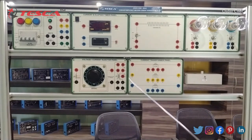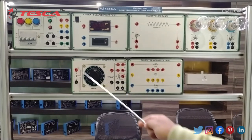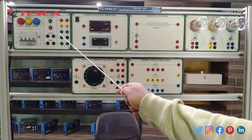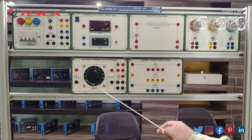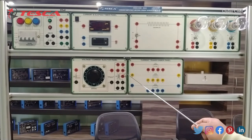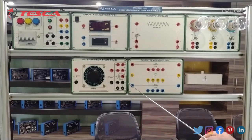Moving towards the fifth panel, we have the voltage and current injector panel. The front terminals are provided which are directly input to the variac. This variac can give an output of 0 to 270 volts at T3 and T4. Input can be connected from single phase or any of the phases and neutral from the three-phase panel. There is also a transformer connected for 230 volt input, giving an output of around 2 volts at 12 amperes for connecting to the earth fault and other sections.